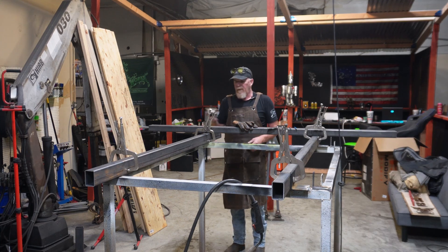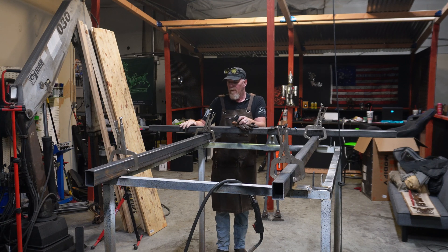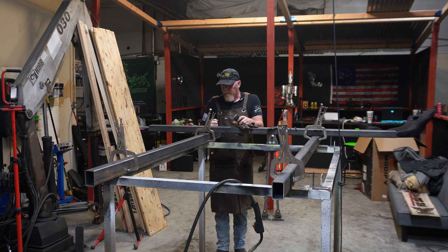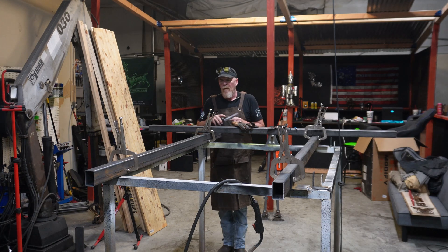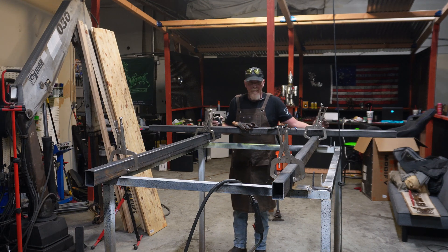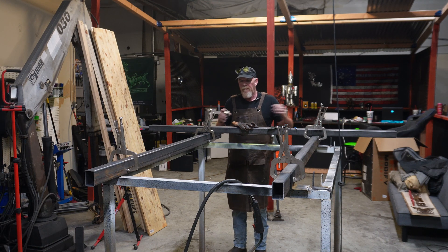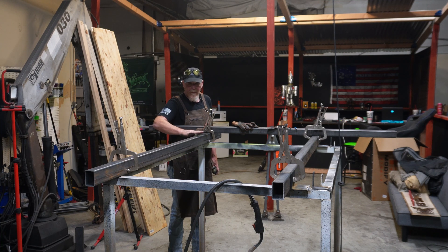On this particular truck, you're going to get your inner frame rails cut out and your two main top rails. Then you're going to lift your main frame rails up on your jig. Now, this particular frame is 33 inches to the inside, so you're going to use your guides to put your side rails up against them and clamp them down real good.